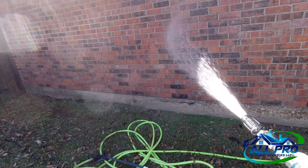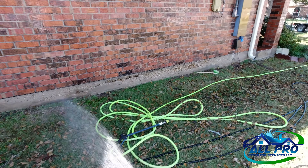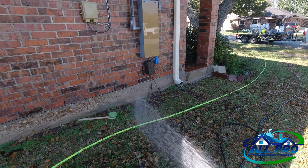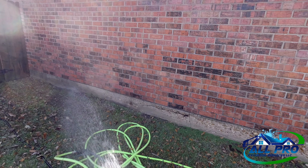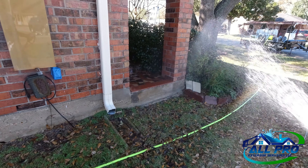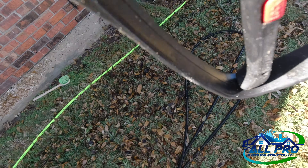Just getting the brick a little wet here. Already done two sides, gutters came out amazing just with the soft wash system. I'm using a soft wash system because I've got a bunch of stuff in the barrel I need to dump — I can make a roof mix but it's in front of this roof which is next. Normally we do the roof first, but the barrel was full, so we washed the house first to help wet the ground. We may even bag this one.